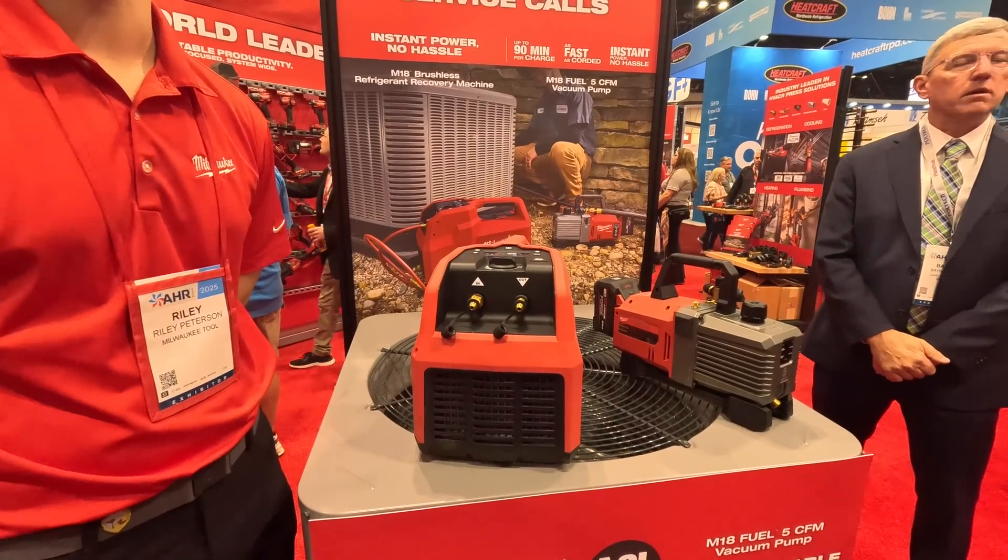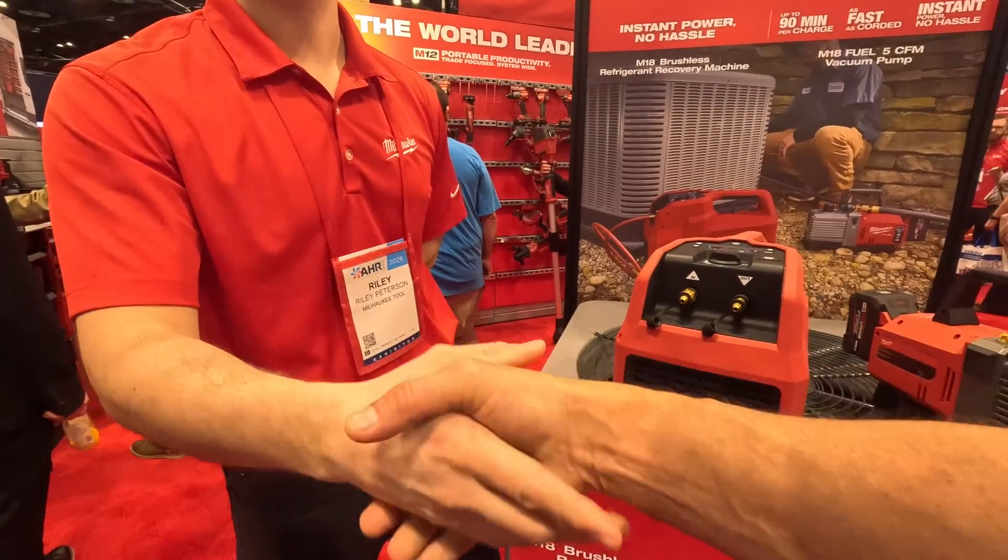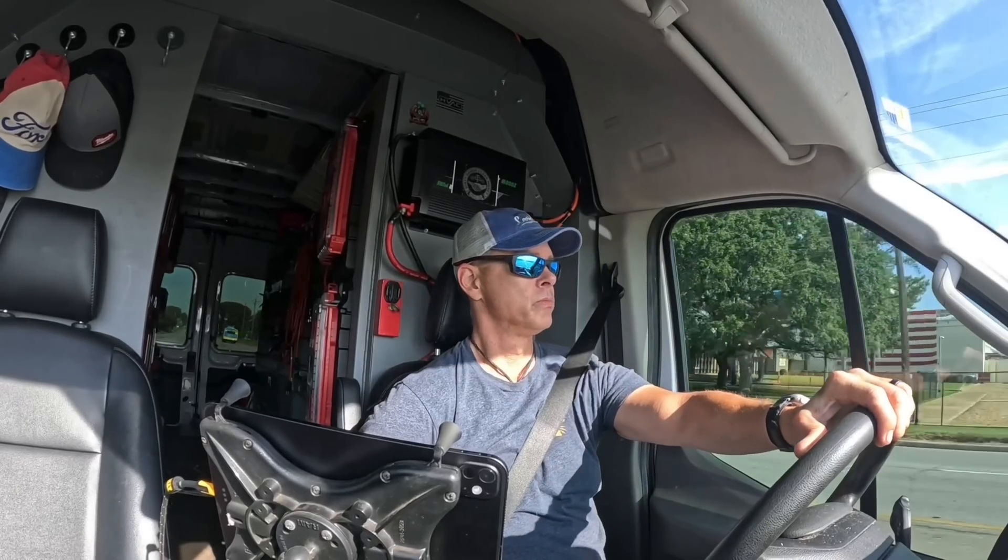Oh man, I want to get my hands on that. Well, thanks for showing me. Thanks for stopping by. So I hope you enjoyed that. From what I was getting from him, it sounds like it was designed to recover refrigerant from a 5-ton system. They didn't want to give me run times, but he did say you should be done in about 15 minutes — so a recovery machine that can run for about 15 minutes and recover a 16 SEER 5-ton. It may not be the save-all we've been looking for, but I think it's a really good first step. Thanks for watching guys and I'll catch you on the next one.